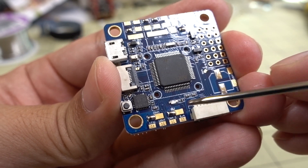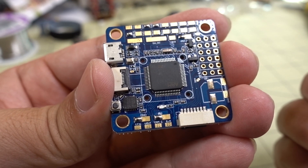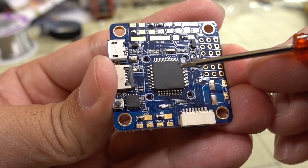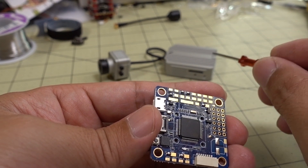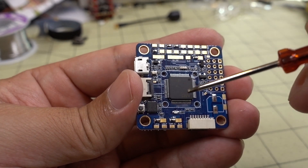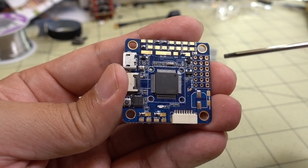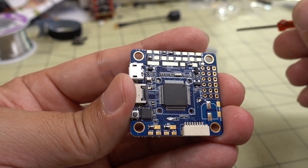The reason you want the 8-volt regulator here is if you're going to use anything higher than 4S voltage. So if you're using a 6S setup, if you put 6S voltage into the air unit, it will just burn it up. So you want to power it from this regulator here. Now if you get power from a regulator on your flight controller board and it's not rated for the amount of watts that the air unit's going to need — it says in the specifications 4 to 9 watts — you probably want to have a little bit of extra clearance just in case it draws more power, because if it overtaxes your voltage regulator and it melts, then it's going to just pass through the 6S voltage and melt your air unit. So you're going to want to check your specifications and be very sure it's going to be providing the correct wattage. In this case it's 8 volts, 3 amps — so that's 24 watts. That's going to be enough for this air unit.